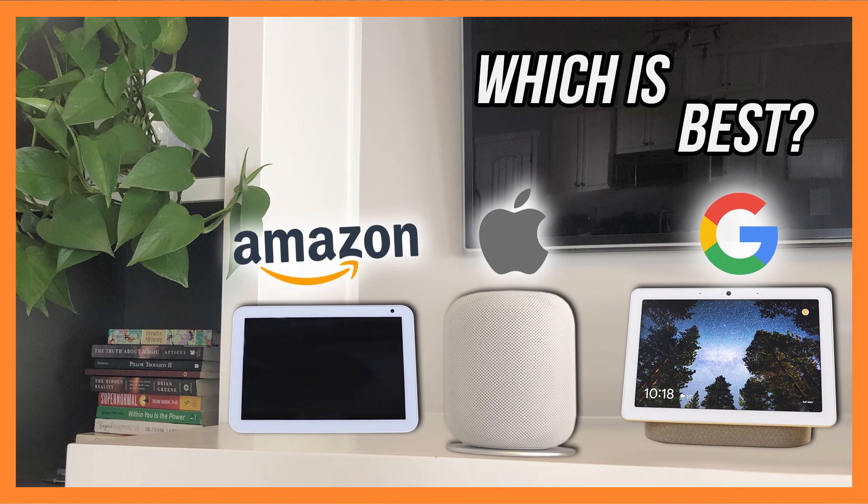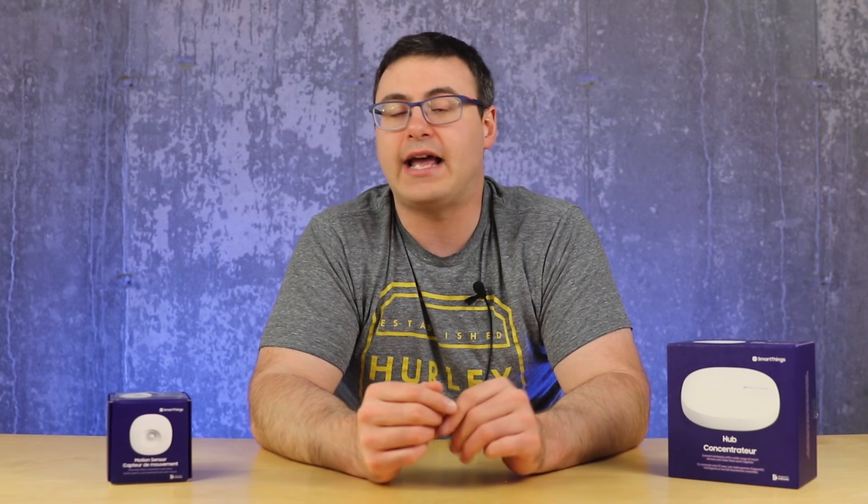On integrating with other systems: Philips Hue is immediate, easy, and happens within seconds through the normal add-device method — just search 'Hue,' add their bridge, and you get all your Hue lights and devices. For Google and Amazon, Samsung devices get pushed into Google Home and Amazon, and you can use those voice assistants to control parts of Samsung SmartThings. For Apple, you need what's called a Homebridge. Amazon Guard uses Echo speakers to listen for glass breaking or smoke and CO alarms — a great thing to have turned on. There's a method for triggering the Samsung SmartThings monitor when you leave or arrive, with a video linked in the description.